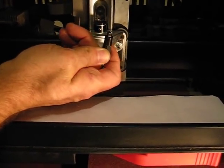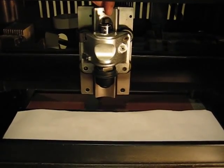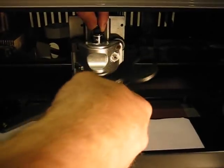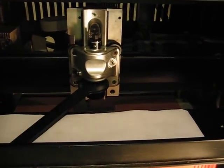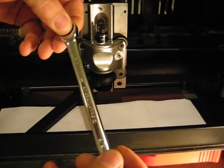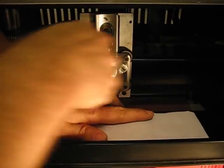The first thing we need to do is take the square tool and place it inside the top hat — it fits perfectly. The wrench will actually hold itself against the shaft while you take the wrench and turn on the top side. I'm using a gear wrench with a ratcheting action; just flip it over to tighten or to loosen. I'm going to set that on my square tool and give it a little drip, and you can see that it came loose.